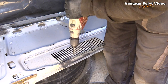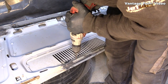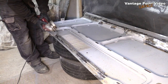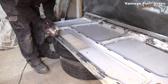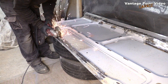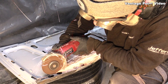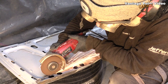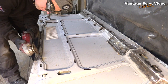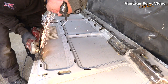On the narrower piece, I just used a drill to simulate the original holes. I would join the dots using the cutting disc in the grinder. I cleaned up the edges with a grinding disc. That was worn down a bit, made it the ideal size to fit in.